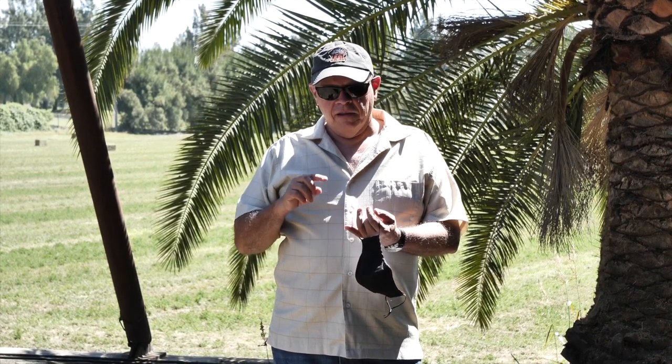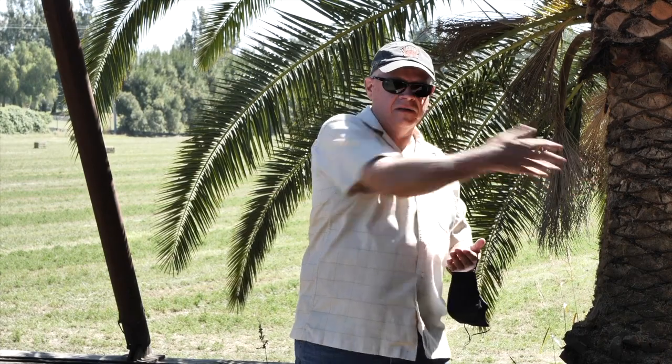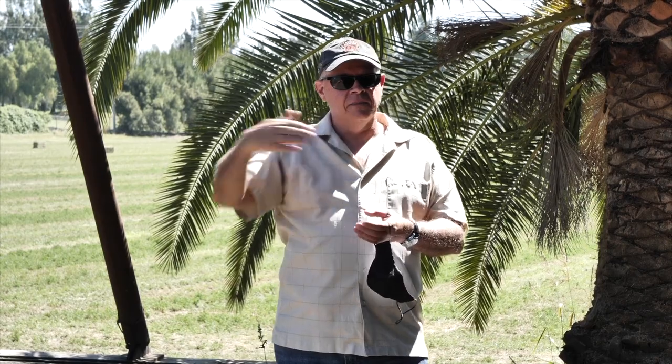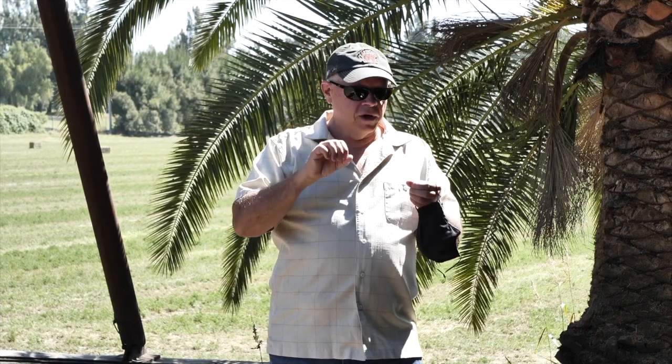So the way the regulations work is there's rules about what they call bypass flows. That's the flows that sweep past, right? The sweeping flow versus the flow you take in. And there always has to be twice as much velocity, and they do that by flow because flow is proportional to velocity. So there has to always be twice as much flowing past as you're bringing in. So let's say we have a 3,000 CFS intake. The river upstream would need to have 9,000 CFS in it.